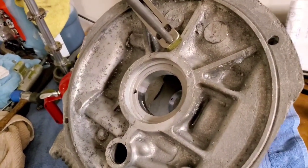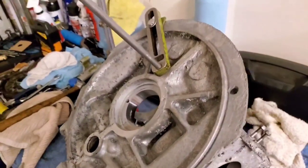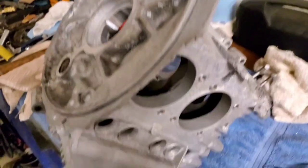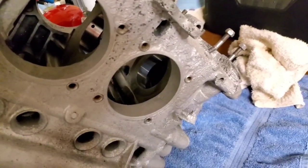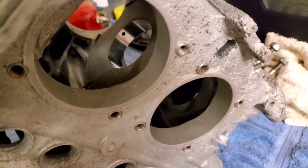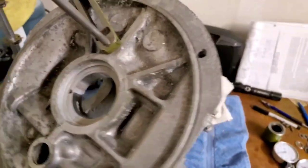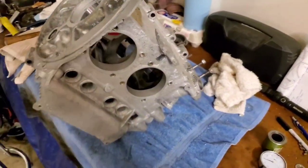The next step I would go about is to go through with a dial bore indicator. These are not any fancy name brand — they are eBay cheap specials — but they get the job done. If you're using a decent quality tool consistently, you should be able to get repeatable results. I would measure my results with this, go through the case, mark out each bearing saddle, determine what I need to do to get it up to the right size, and readjust the cutters. I can go over that in a different video if you guys would like. This was just kind of to give you guys an overview of how I set up this old line bore tool. As you can see it does a pretty nice job, so if you guys have any comments or questions go ahead and leave it below.